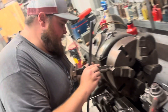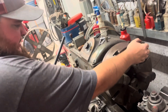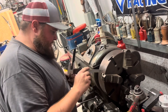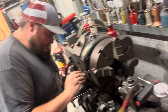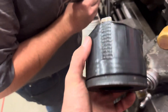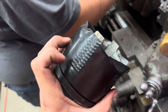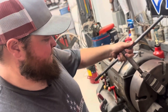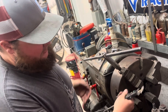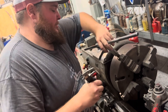We are trying our damnedest to get this sucker lined up, kind of square, because we had an issue where we were way out of round. Things that look proper, once you put an actual measuring device on them, usually aren't. In order to help try to save some of the piston wall, we're putting tape around it, but that tape changes the compression — otherwise you're going to really mar up that skirt. So now we're setting basically a base on the chuck. Once we get the base set, we put the piston in it — the idea being that all four jaws stick out the same amount and you tighten them the same degrees, so it'll be closer to center.